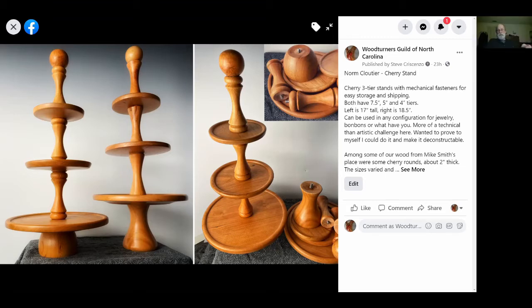No, I was thinking that you would have had a nut at the bottom of each of those vertical pieces and a threaded rod in the top. Do you follow me? Not quite. To have like 1 inch of threaded rod that would go through one layer and into the next. Oh, yes. It was just going to be easier to turn the pieces by not having the threaded rod sticking out of the flat plane. One or the other had to have the thread sticking out, and it just made more sense to me for breakdown and saving that it was easier to put the threaded rod into the verticals and ensure that that long strip would definitely straighten itself out as I drilled in.